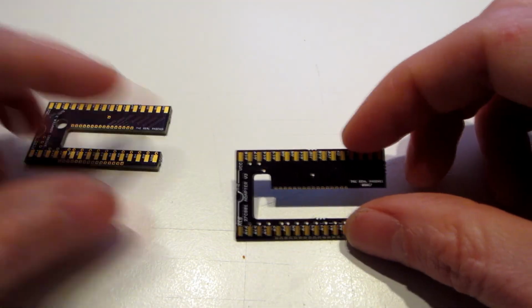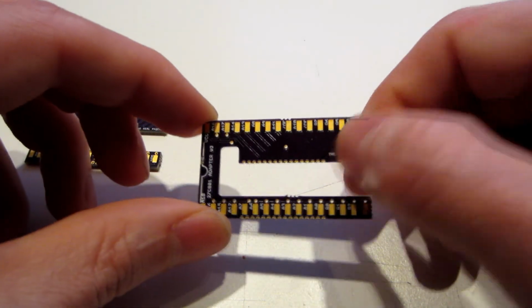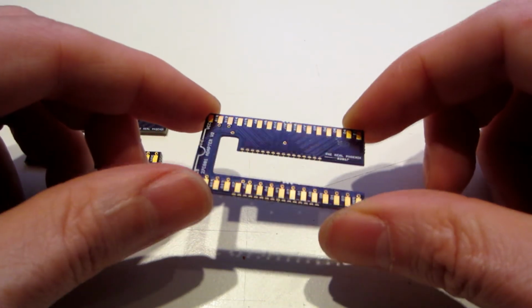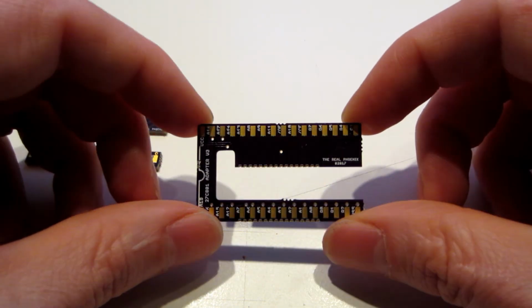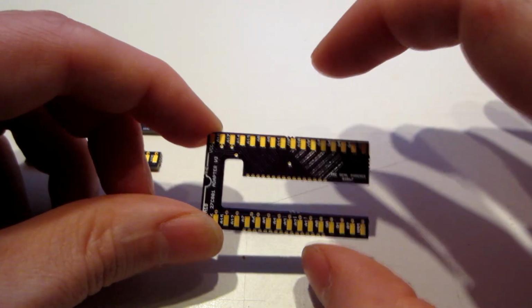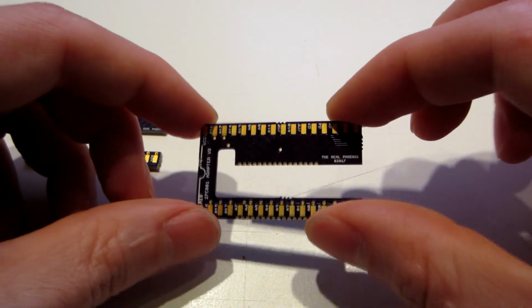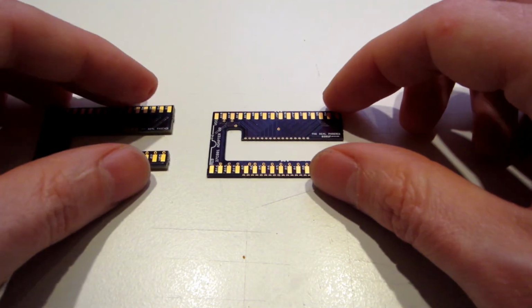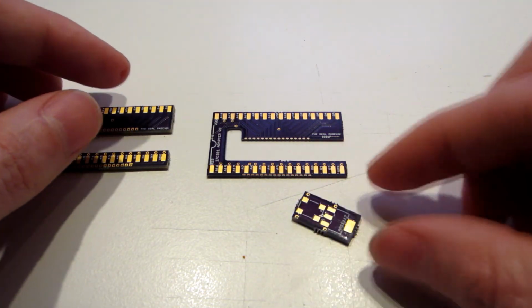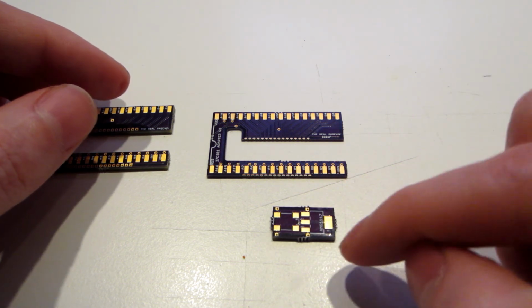This is the V3, and this time I'm using castellated vias, and it should simplify the installation because you don't need any hot air station. This one is a little bit too high, and I will provide in the description a link to the right one. I will also give you the link to the new version of this adapter.